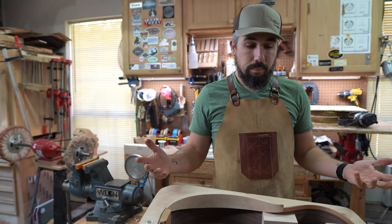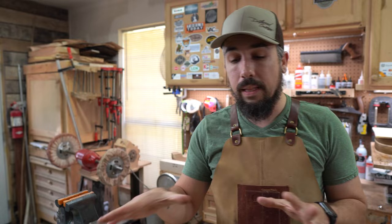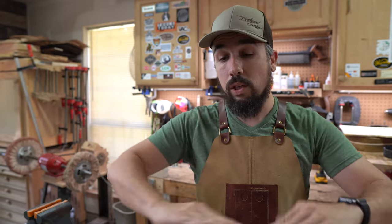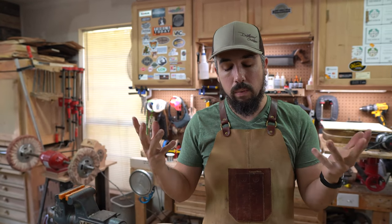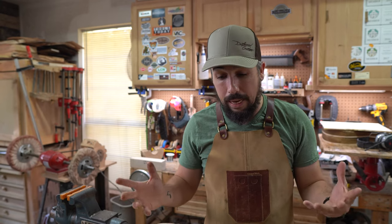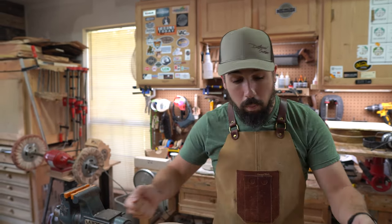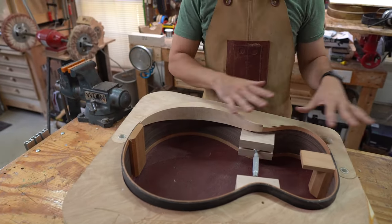The reason why we do this: A, that's how I've always done it and I know how to tune my guitars based off that radius. The other part is that adding that dome actually adds strength. Remember when we did the voicing and gluing on the braces at the top — we put that dish, that radius, into it. So it allows us to have a stronger top while bringing the braces down a little bit lower. What we need to do today — a lot of people call this 'driving the bus' — is take this whole body inside the rim and go back and forth to put that radiusing into the back.